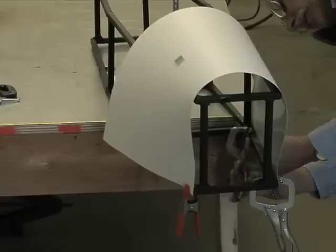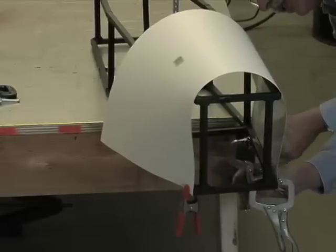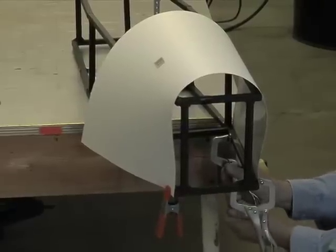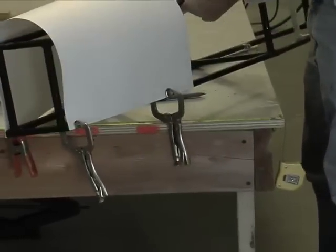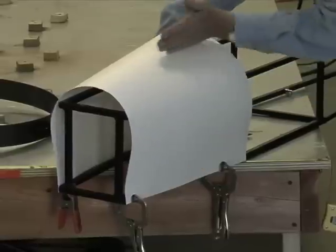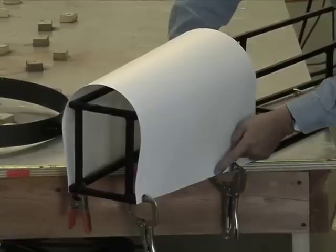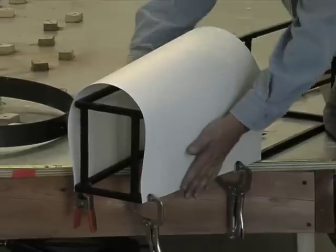Now this is better than just all flat panels. That looks a little frumpy. This isn't a super sophisticated body, but it's a little bit better. And you do have some curve on the profile. I'll turn it sideways to show you. So you have some tapering down here, but this is a straight line. There's no compound curve. And you could bring in the sides and attach it with blind rivets or sheet metal screws into the chassis itself, and you have a body coupling.